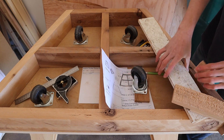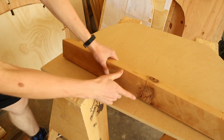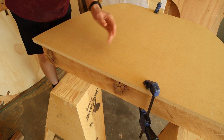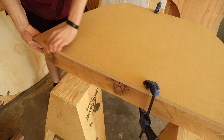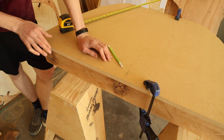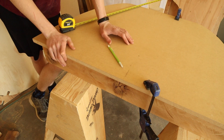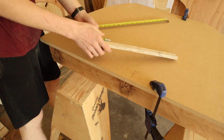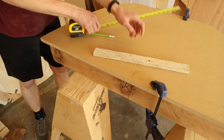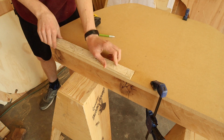As I add more height, there's more clearance. I lined up my lines, clamped them, and then turned the piece of wood over. The clamp is to keep its position so it's all lined up. Whenever I'm screwing things in, I want to have a fairly uniform screwing pattern, so I'm going to make a jig for that. I'm going to get a 16 inch long piece of OSB, cut it 1.5 inches wide, and then I can use it as a guide.